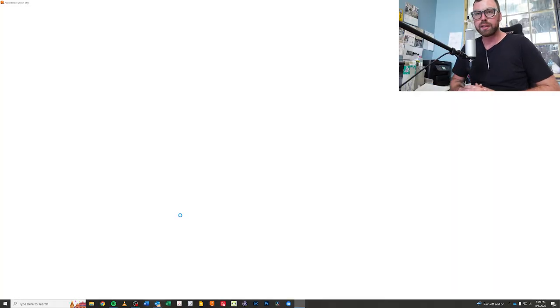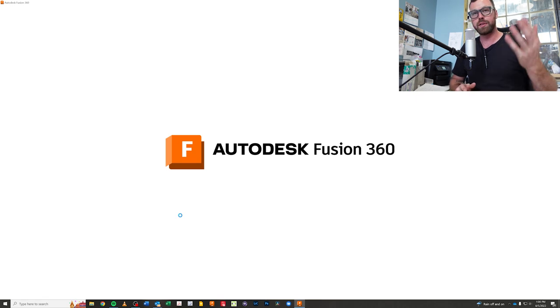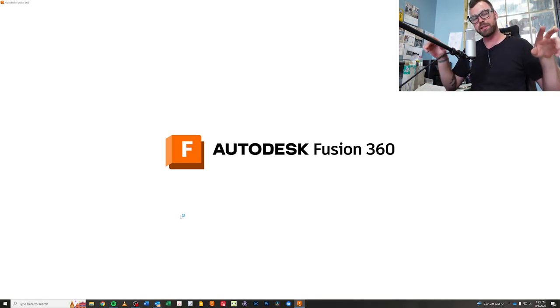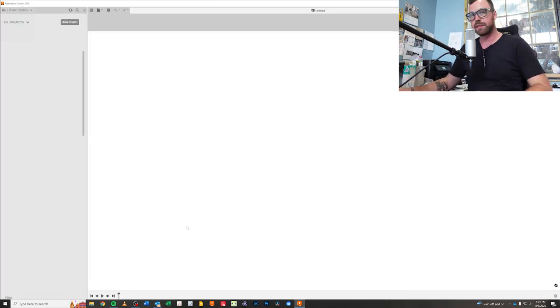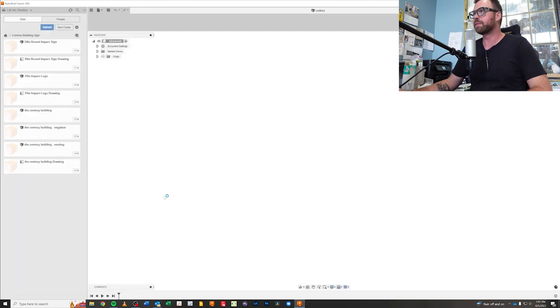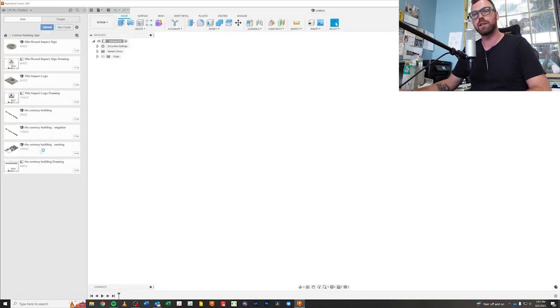All right, so open up Fusion here, and see if there's any graphics that I already have for this design. This design element, rather. And what I'll likely do is find a graphic that I like, bring it into Fusion, set it up as a canvas, trace it, trace one side, mirror that side so they're symmetrical, and that way I have a scalable selection of curves that can be defined as a fleur-de-lis. And then I'll send to the plasma cutter, we'll cut it out of quarter-inch steel, I'll heat them, I'll hammer them, I'll distress them, just like the base, fleur-de-lis.